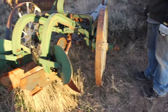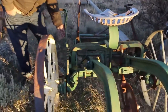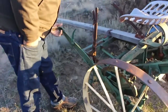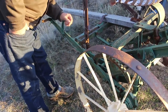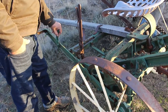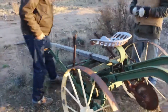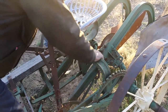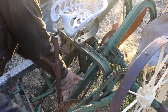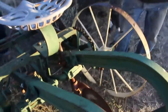With these old plows, if you're looking at one in the field, it's not uncommon to see a rod broken or even a handle bent. The cast handle - these castings - if they were cracked or broken, they could be brazed and you'd be okay, as long as you have both pieces or someone who knows how to MacGyver something up. The levers are something you could fix or make. Going back to what we're talking about: if you're thinking about buying one, you don't want any break or bend in the frame, any bend or cracking in the beams, or any problem with these short axles. And wear - if they're wearing really bad, there's just no fixing that.